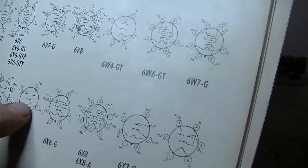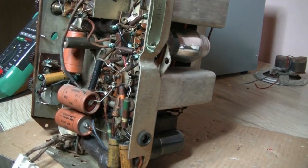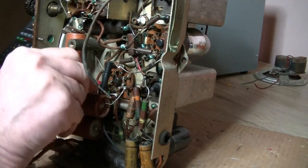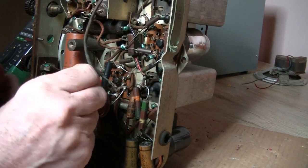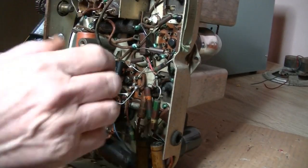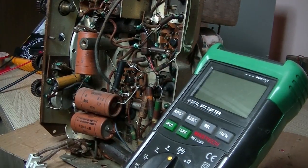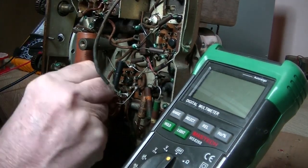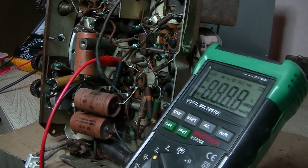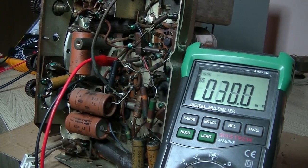So this will run off 6.3 volts. So pins 3 and 5 first, and then 2 and 7. Which 3 and 5? Where are we counting? From the notch. 1, 2, 3, 4, 5. Take my word for it. And that's dummy. It's a signal generator, tone generator. So let's get the 3 and 5 and count again. 1, 2, 3, 4, 5. There's a multimeter. And a bit of power.